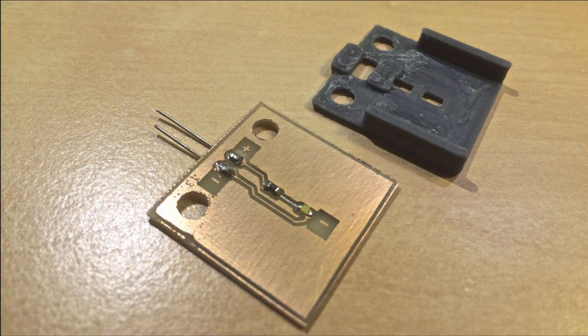My redesign consists of two parts. One part is 3D printed and is identical to the lower part of the original bulb housing. The other part is a custom designed PCB that contains the light emitting diode and the current limiting resistor. The 3D printed part is simply glued on top of this PCB and the LED sticks out through a small orifice.